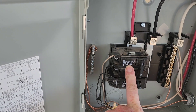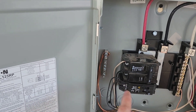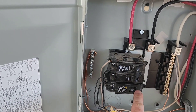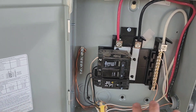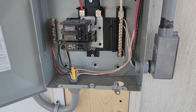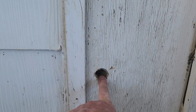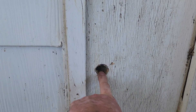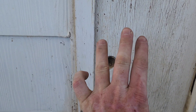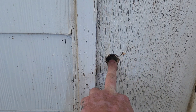Got the hot water heater wired up. The 15-amp to the shed is not on yet because it still needs to be connected to stuff inside the shed — I haven't set up a switch, light, or anything. The 20-amp to the freezer and other outlets is all hooked up. Freezer's back on. Now what we need to do with this box is drill a hole and run two 20-amp and one 15-amp wire through it.